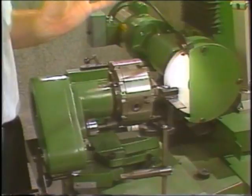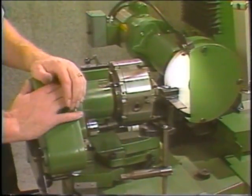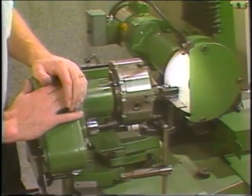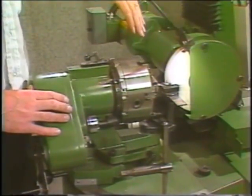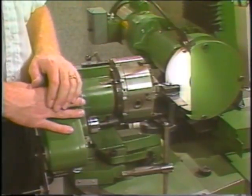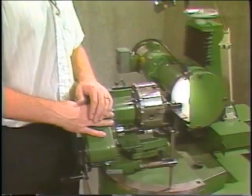If you're doing a 180-degree included step, you have to use an undercut wheel, otherwise you'll be grinding the side of the pilot when you're grinding the step. There's no way to eliminate the problem of the radius with the grinding wheel on this type of step.